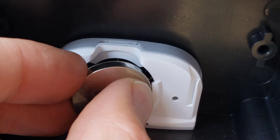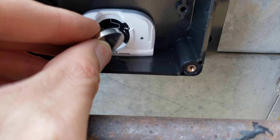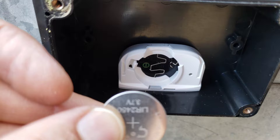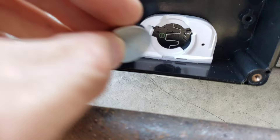When I was trying to put it in I saw a spark and the battery got really warm for a second — hopefully I didn't do any damage. What happened is the contact here shorted the battery. I'm going to grab a fresh battery since I shorted it. Be very careful when inserting the battery here because the spacing between the positive and negative is very small and it's very easy to short.